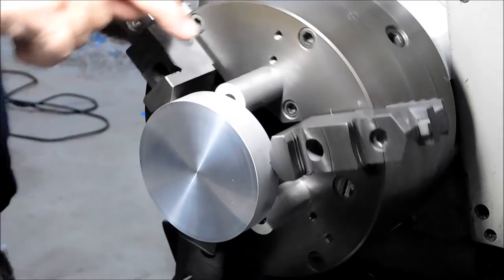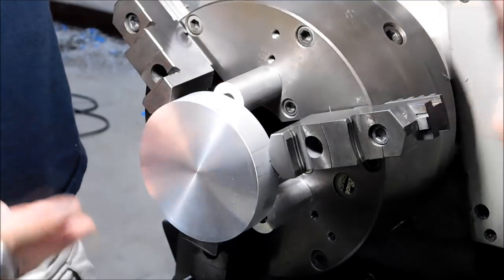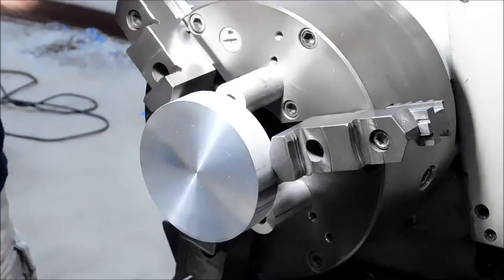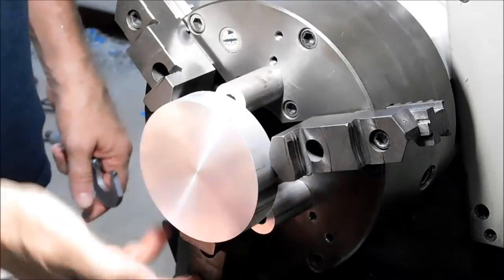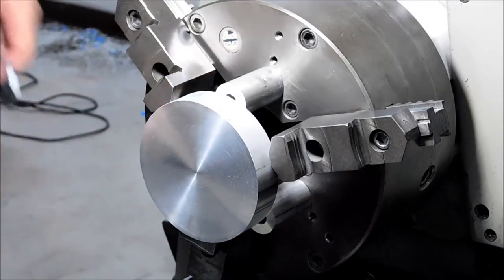This standoff technique works exceptionally well. It's adjustable for a variety of diameters. It works with the jaws inside, outside, regardless. And if you're not sure about where the stud came off of, by all means dress it off like I just did — it takes two minutes. This is a great trick.